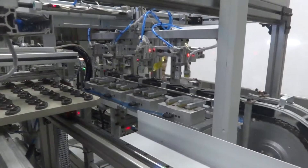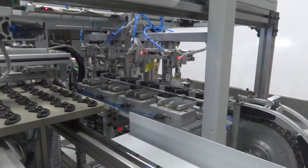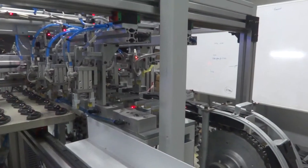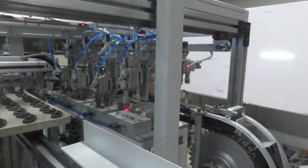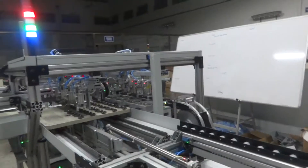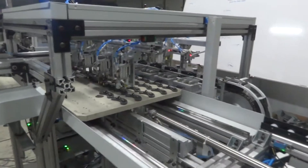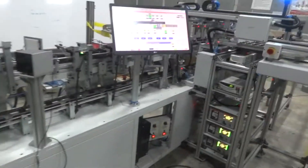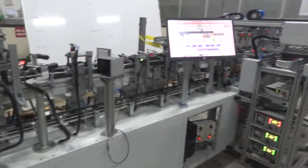We will give you a brief demonstration of how the loading tray containing the various units is moved from the XY table onto the leakage test. This unit picks one at a time, moves forward, and drops it into the leakage test station where leakage testing starts. Meanwhile, the short arm is ready waiting for the tested units to be placed onto the main conveyor for further operations. These operations keep happening one by one until all the units in the product tray are empty.